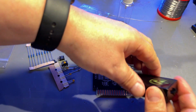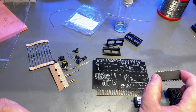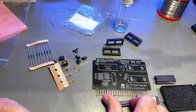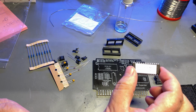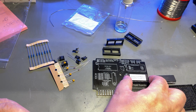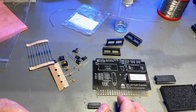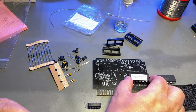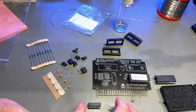soon. And here are 1 EEPROM and 1 32 kilobyte RAM and 1 logic chip. And the EEPROM that Sven supplied with this is this one. It's RAM test and diagnostics testing, and that means that the other socket is available for whatever you want to put onto this. And what chip is used, or what bank on the chips are used, you can control with some jumpers. I'll get into that later.